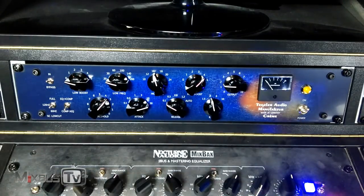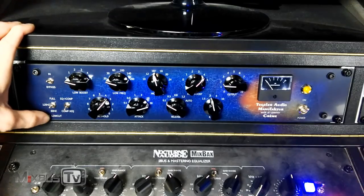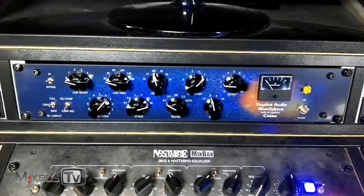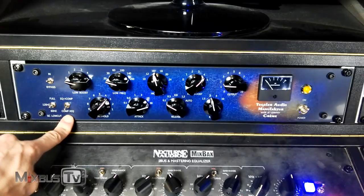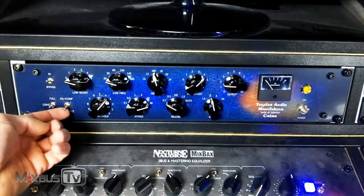First, an overview of the panel and controls. From left to right: bypass switch, it bypasses the whole unit, compression and equalizer. Sidechain low cut switch, it goes from full, 60, 120, essential on compression for me, especially on SSL and 2-bus style compressors. Then the routing switch, pay attention to this one. This one changes the routing of the unit. You can put the EQ before or after the compressor, just with a flick of a switch.